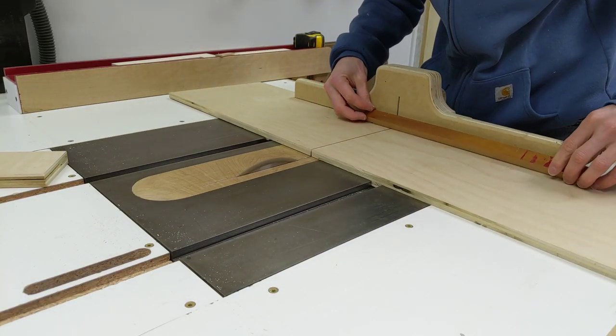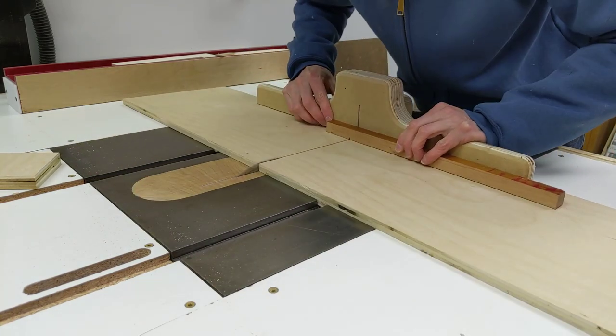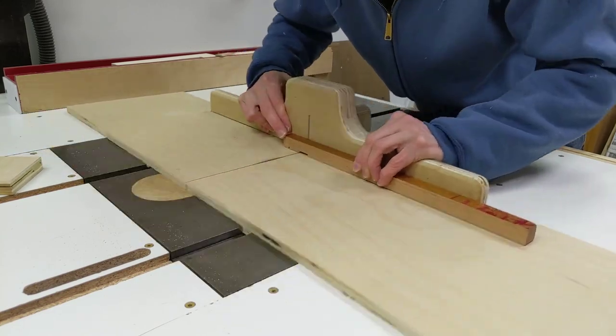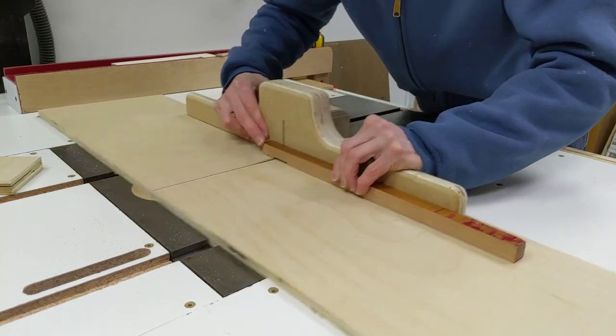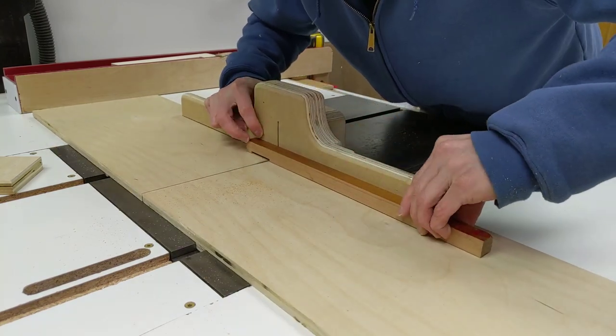The next part I'm making is the wooden spring and rub plate. Because it's such a small part, I'm actually cutting the features of the part into this larger piece of wood and then cutting the part out itself. That way I can have the larger piece of wood to hold onto and not have to have such a tiny little piece to work with.